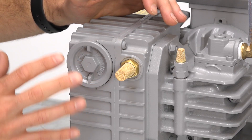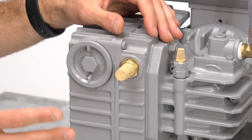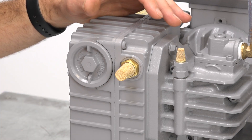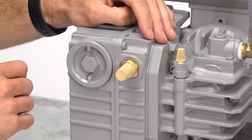Another great feature of the EC20 pump used in this system is this oil mist separator, which filters and recovers oil mist emitted by the pump during operation. As a result, in normal operation, negligible oil vapour should be emitted into the room, making it ideal for using this system in more sensitive environments such as schools, labs and more confined workshops.